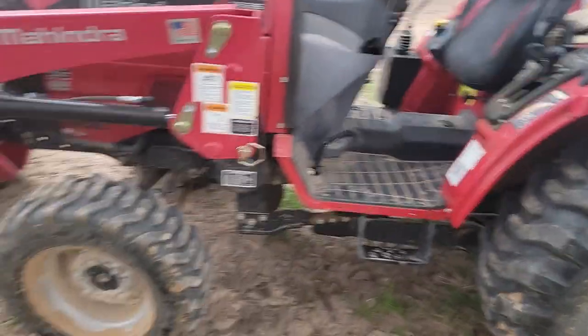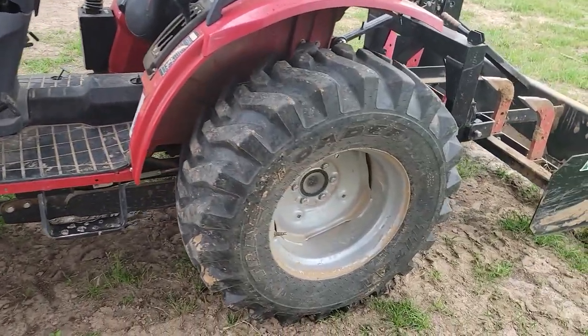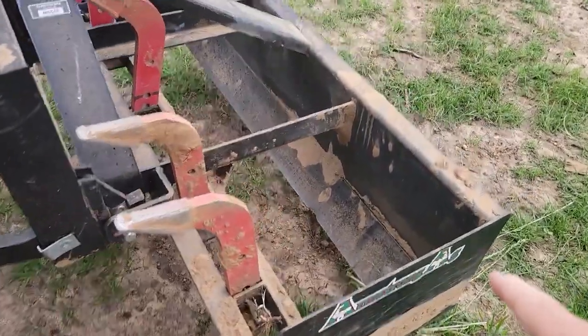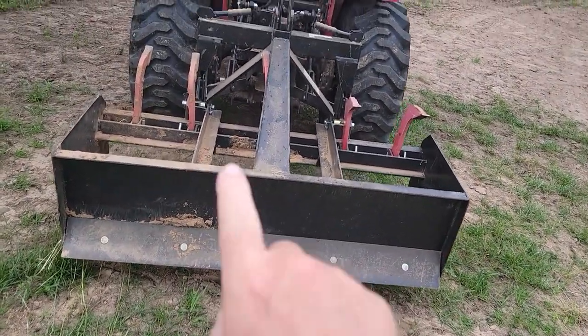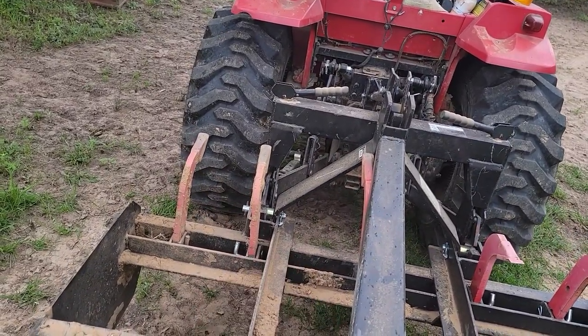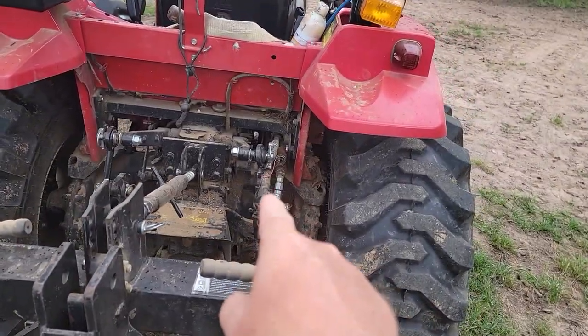Normally videos have some entertainment value, but this is my personal journal of what I'm doing and why it's taken me so long to build a house. I'm not just building a house — I'm off-grid living, and that means restorative agriculture. It means repairing the road when the conditions allow, so I have to stop what I'm doing on the house. The man of the hour is this little Mahindra 1626 — it punches way above its weight class. I set up my box blade at an angle, dropped it down into the ditch, drove in, and rolled the ditch material into the road, adjusting with the linkages as needed.